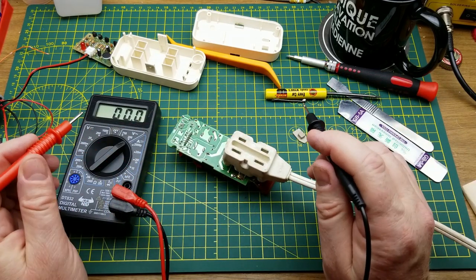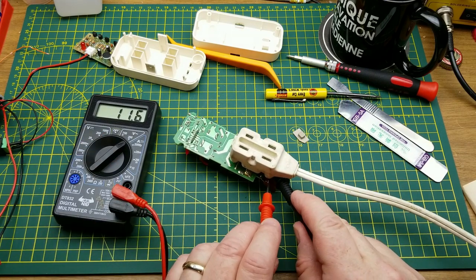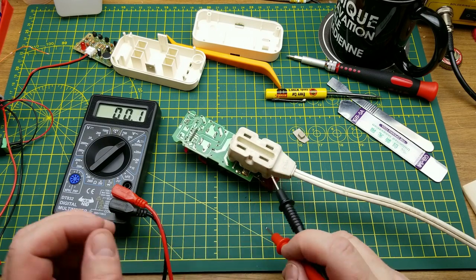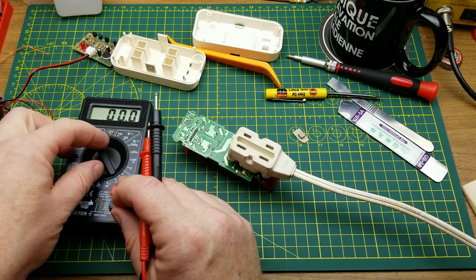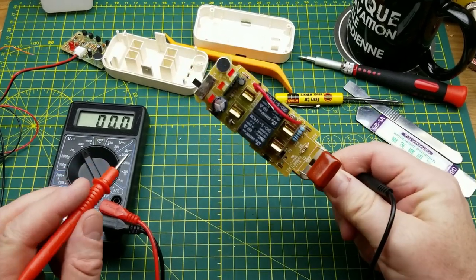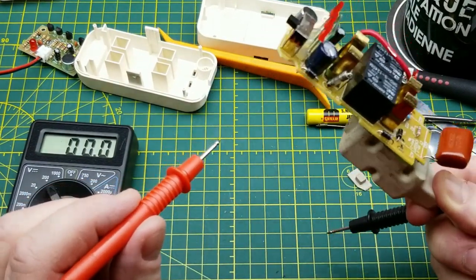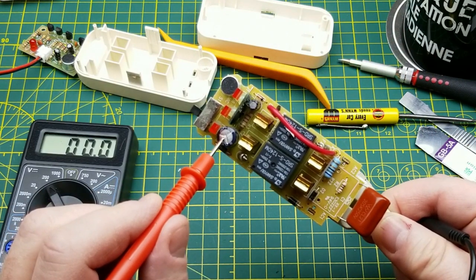This is in fact a live circuit so be very, very careful. Let's measure across that capacitor - yeah, it's got 130 volts. It has the entire line voltage across it, so it's just in parallel with the resistor to smooth it out and make it safe. I'm going to guess this larger electrolytic capacitor down here is probably smoothing the power supply.